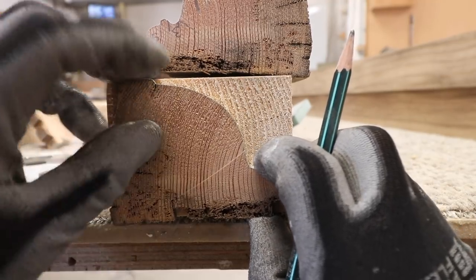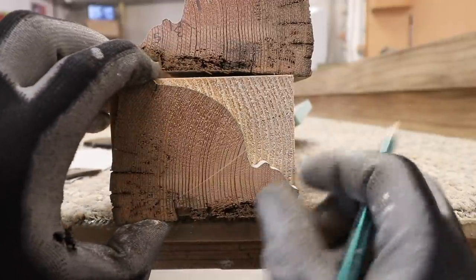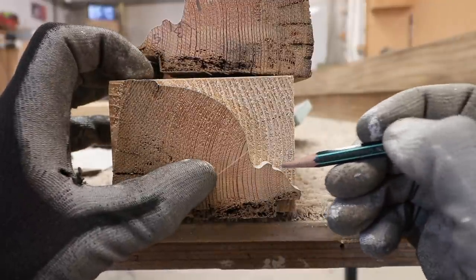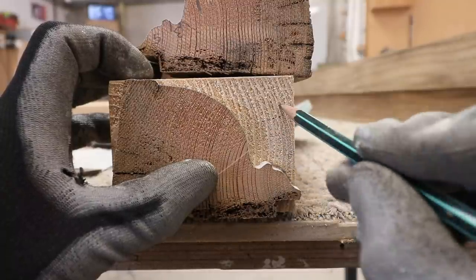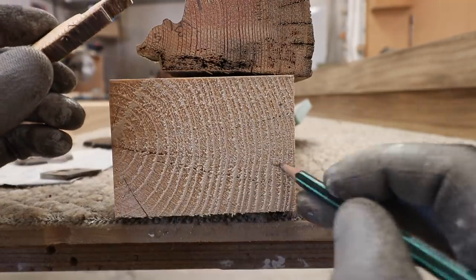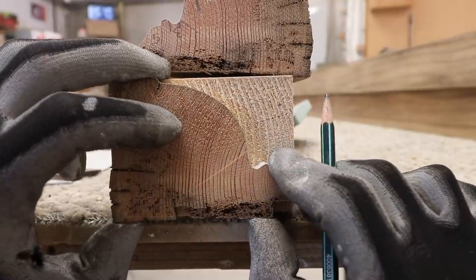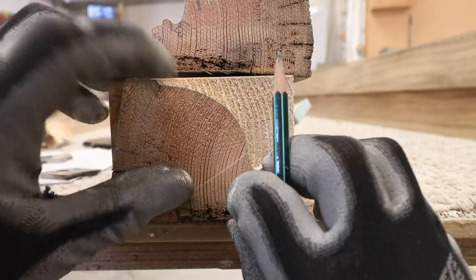This piece of wood isn't quite as big as the sections that I'm machining from, so I've just got to be careful with this cut that I do from the back edge here. So that's the only one that I've got to be really careful on, because this piece that I'm using as a pattern section isn't quite as thick. So when we're referencing off this edge, that cut is going to be different on this to the actual pieces of wood. But for the sake of getting another piece of a core out to use as a pattern, I'm just using this small bit of softwood.